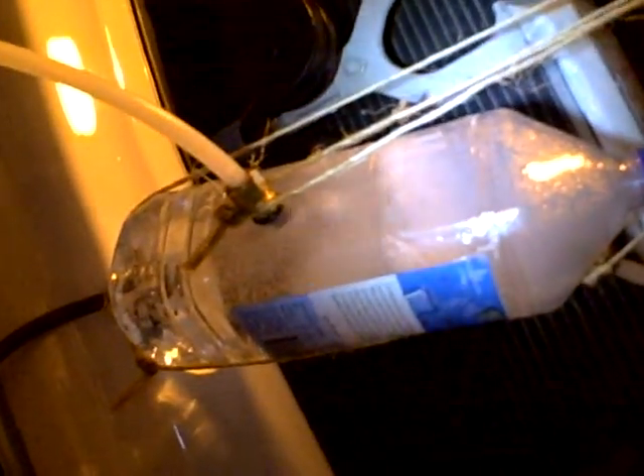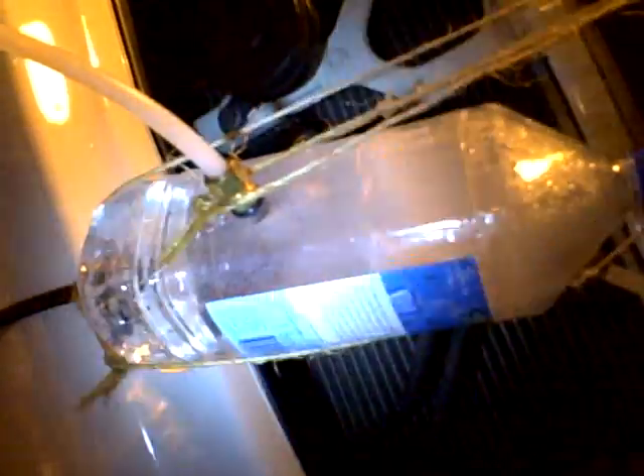Here's the system guys. We're coming out through the bottom here — water flow here. We've got a circulating system, and we're coming right into the cell. Here's our HHO generator — we have a sealed system here, coming in the bottom. 11-plate design. We have our positive connected in the middle, two outer negatives, coming out to the top side here, and right back around for our production results.